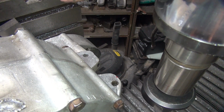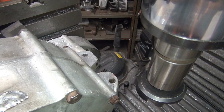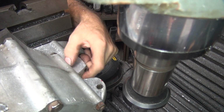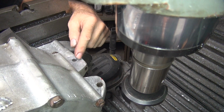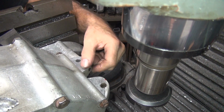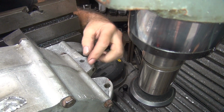They didn't burn all the crap out of the aluminum when they were welding on that previously welded piece. It was full of pan head muck. Yeah, that was the one. Remember I told you you didn't want to weld with the crap? Yeah, that's why. Porosity. But most of it's pretty good. It's just right along that parting lip. I actually put a lot of material down. It's just right along the edge where I didn't put much. I didn't weld it over here at all. That's the original over here.